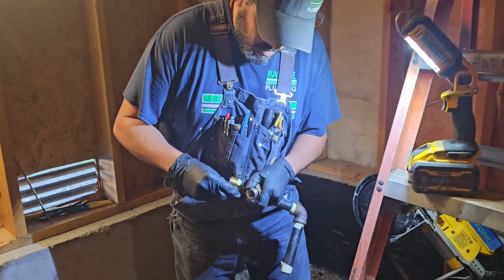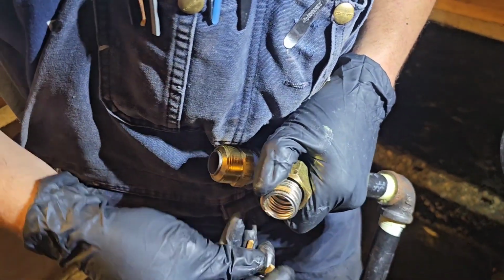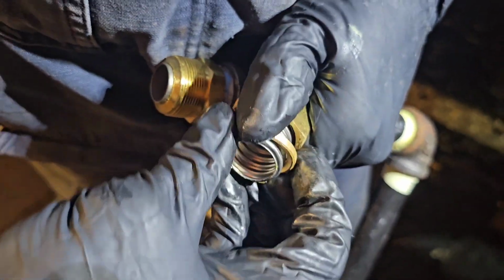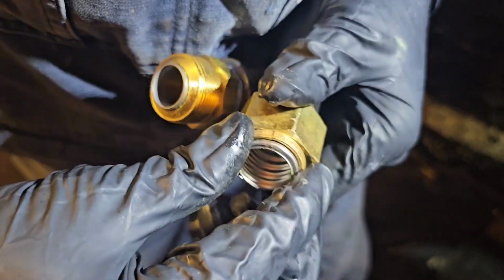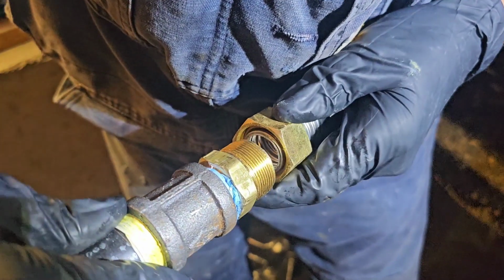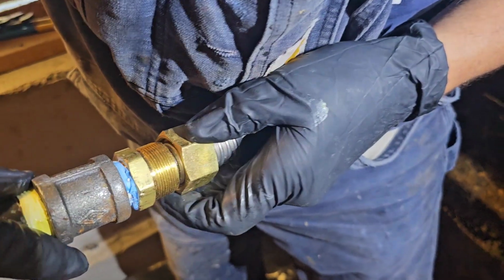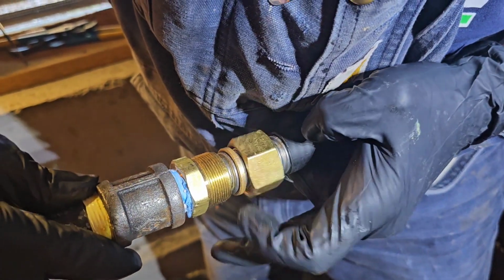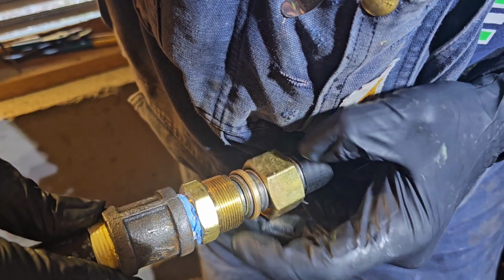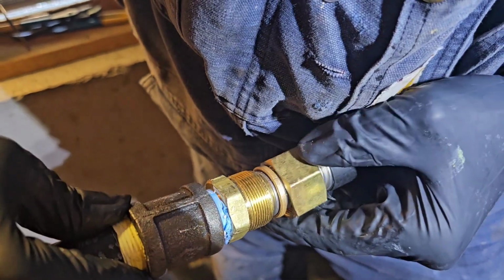Okay, here we go. Take a good look at this. Put your two rings around that. I'll do it again. Put your two rings around that first ridge. Okay. Put your nut back over the rings. Now the rings are locked. Now look. That piece goes inside the pipe. And you got that little tapered receiver end right there. And this nut, as it threads onto here, is going to jam these rings all the way to that material, which is sandwiching this little bit of stainless steel right here on that tapered smooth edge right there.